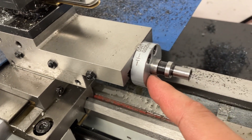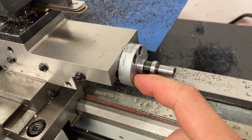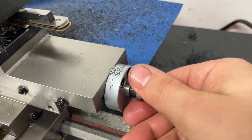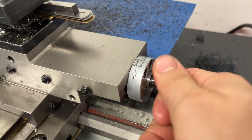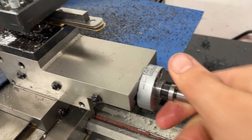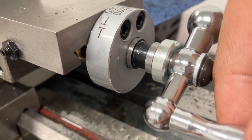What I actually did was I went extremely slow and I bored this ID slightly bigger, and just kept doing it until I can spin it by hand. There is one little tight spot right there, but as long as I can spin it by hand, it's much better than before. Before I wasn't able to spin it with just my fingers. You can actually see the wobble in the shaft.